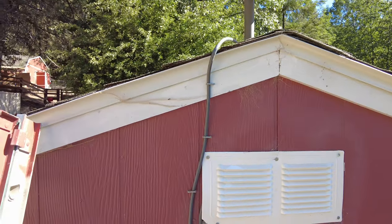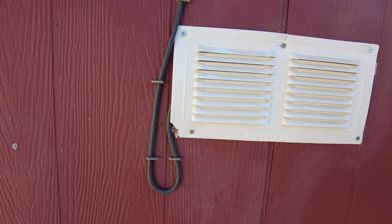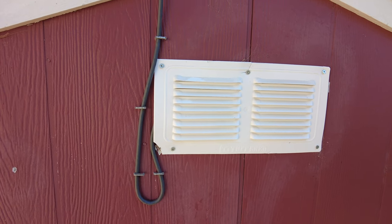I've got this cord coming down here and in through the vent. We'll seal it up with some nice silicone later on. It runs inside, comes back down to an underground ethernet connection, which goes over to the network shed in the background behind me — that's where the network on the rest of the property disseminates from. There's 200 acres. We've put in a fiber backbone powered by all Ubiquiti equipment, with long runs on fiber that drop back into ethernet and Ubiquiti setups, with Nano units spread throughout the property, UAC Pros, and a couple of mesh ones for filling in certain areas.